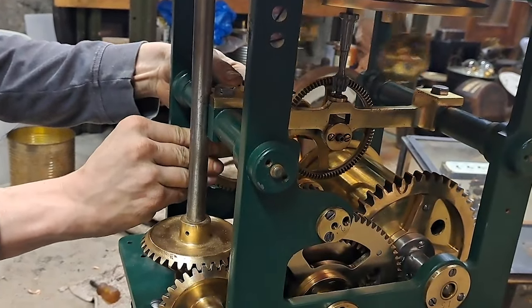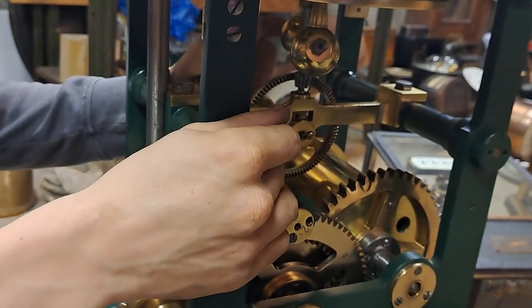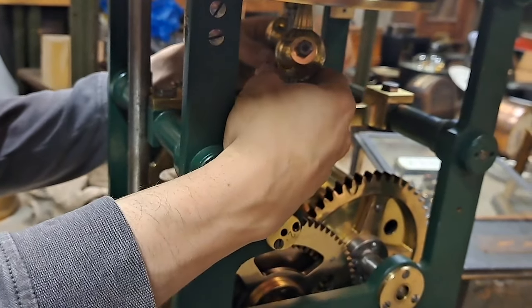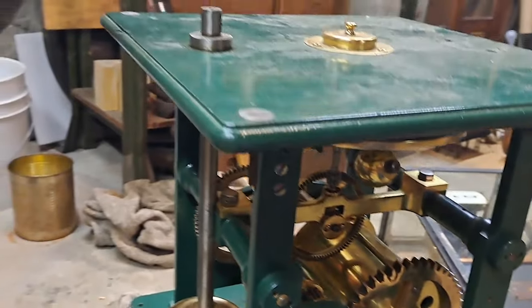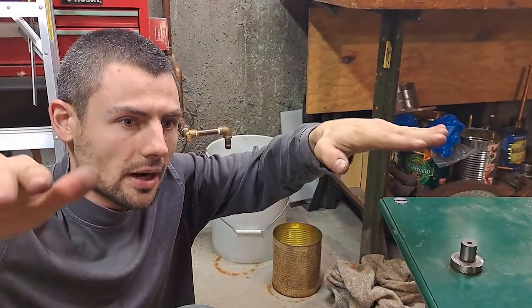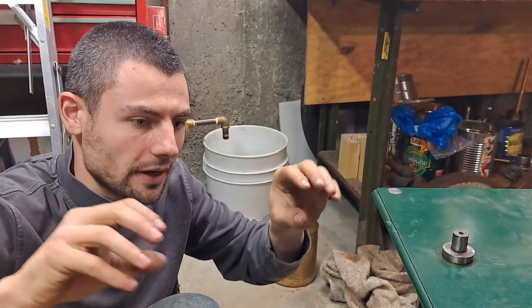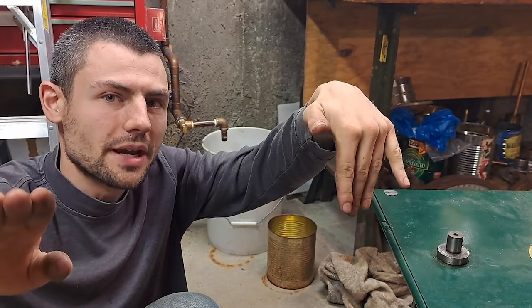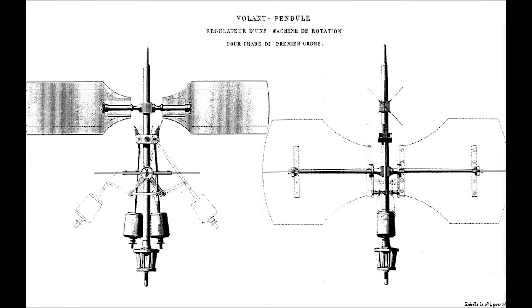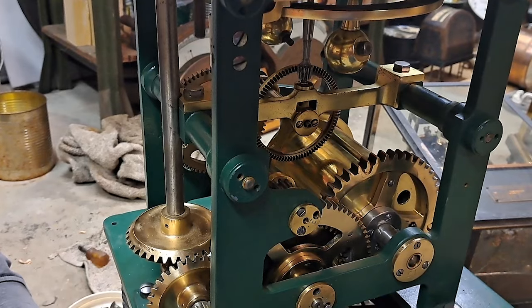My favorite sort is where instead of a friction governor, there's an air brake governor, where like Bernard Barbier Turenne built those, where the governor weights, when they came up, they drive a little rack and pinion or some mechanism where there was a big kind of rotor, like helicopter blades with a collective, and they would vary the blade pitch as the weights went out. And the further the weights went out, the further the blades would sort of turn into the airstream to make air drag, and that would regulate the speed. So there was no rubbing together of any parts or anything. And those are my favorite type of lighthouse governor.